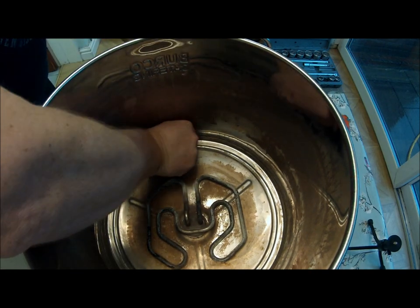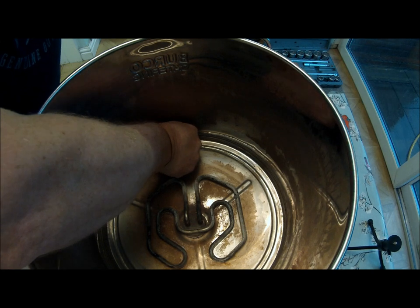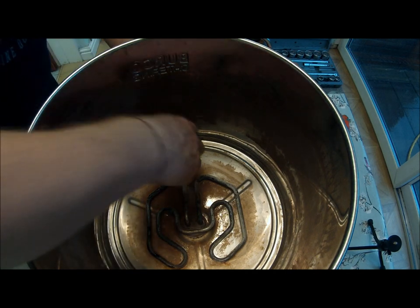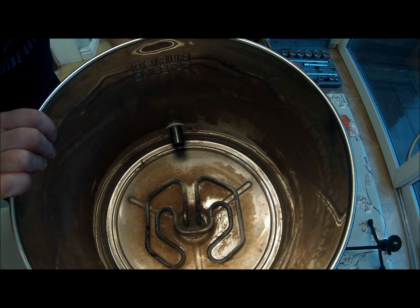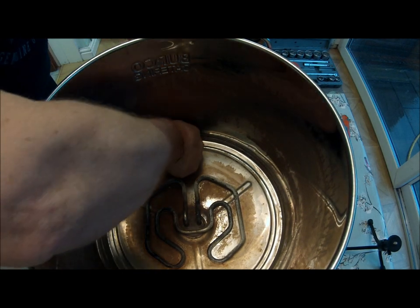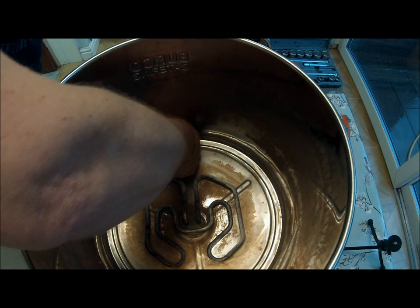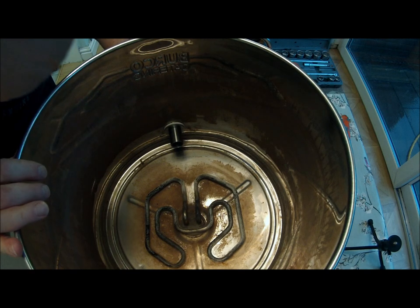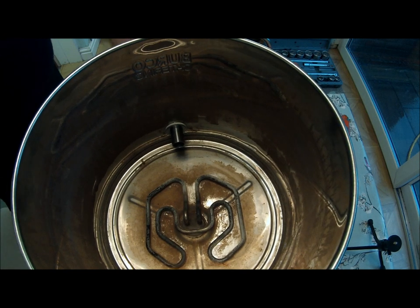What I'm going to do is turn the inside, then just turn the tap. You generally don't want to over-compress washers too much because it deforms them and stops them actually working correctly. But I might give that a little another quarter turn roughly. So I was turning both the tap and the inner pipe, and then just turning the tap on the outside — that feels fairly substantial.